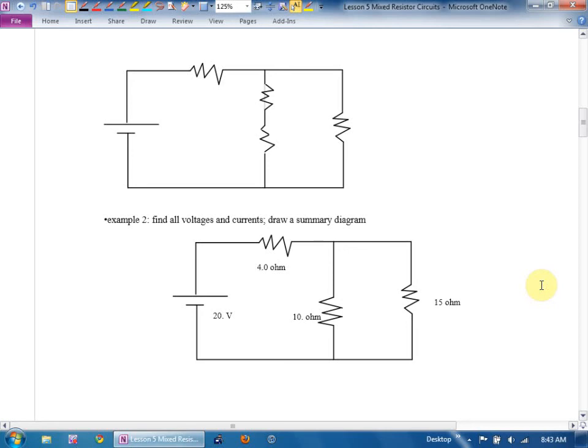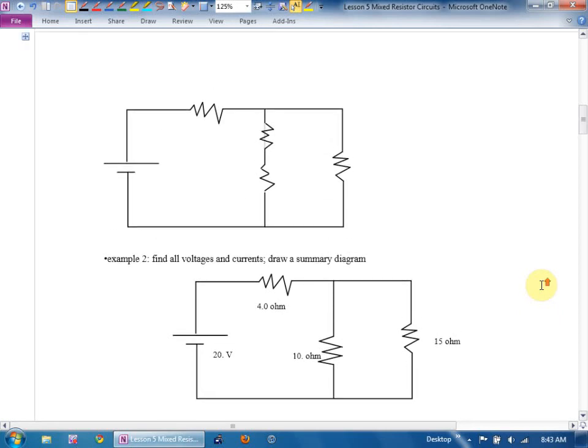So what we're going to do for this one instead, as a little twist, is I'm going to write up here, find R total. And I'm going to make up numbers. These numbers almost certainly will be yucky. I'm going to say that this is 10 ohms. I'm going to say that this is 8 ohms and 4 ohms. And I'm going to say that this is... trying desperately to do some math in my head, hoping desperately to make this work out evenly. I doubt it, though. I'll call this 18 ohms.